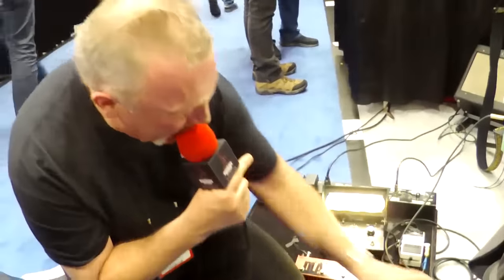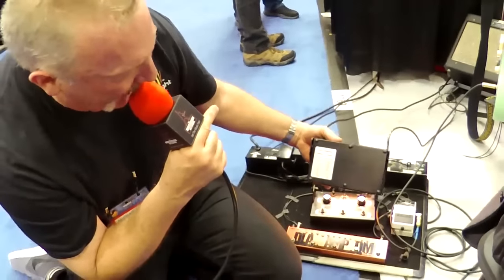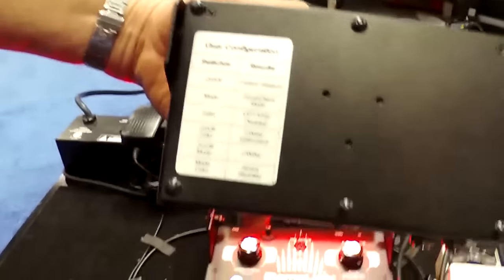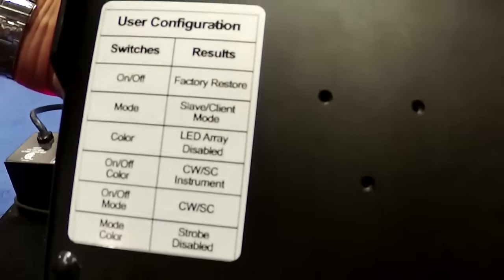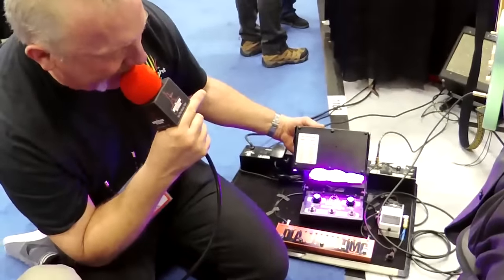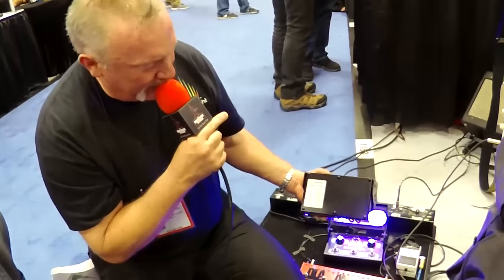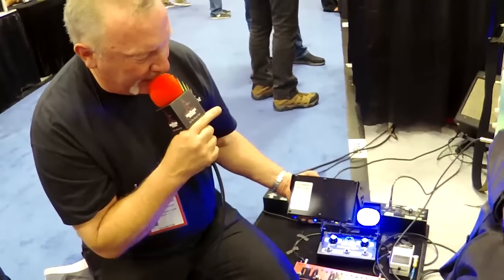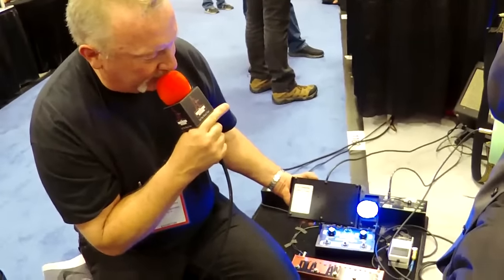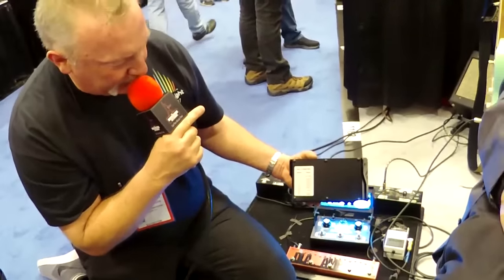Now, let's say you don't want a strobe. One of the things you can do is use the user configurations to simply disable any of the particular effects by holding down the on/off and mode buttons when you power up, or the mode and color buttons when you power up. That includes turning one of these into a slave or client — for those running DMX who want to put this in their line as a slave. Or if you have multiple units, you and a partner can take turns being the controller for your set. This will also work with most DMX 512 systems as a slave.